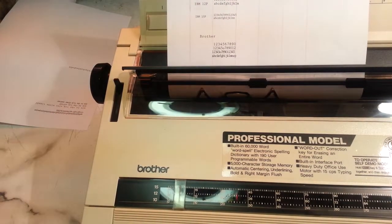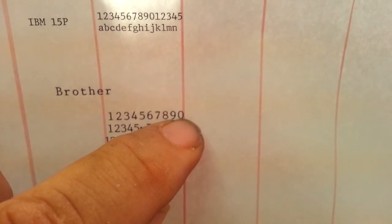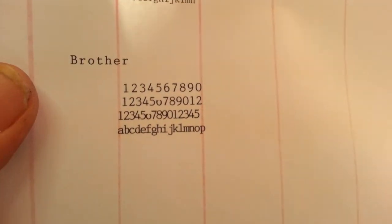Let's pull this out and see what we've got here. So the Brother: this top line here is 10 pitch — there are 10 characters in that one-inch space. When we move that to 12, it goes 12 characters in that same inch space. 15 — it goes 15 spaces. Now when it does that, it kind of crowds the letters; they actually touch — the numbers touch and so do the letters. Uppercase would be a little bit worse even; they would really crowd. But it will fit into a smaller spot. Let's put some capitals in here so you can see how much it crowds when it's in micro print.